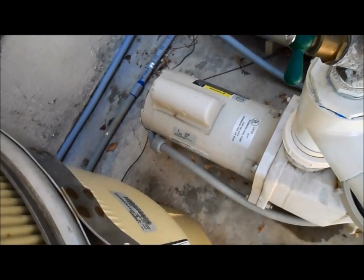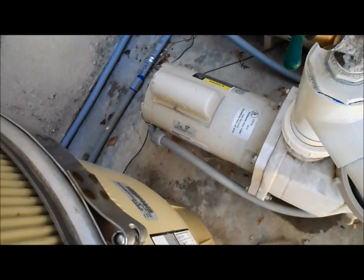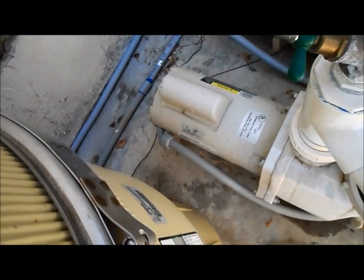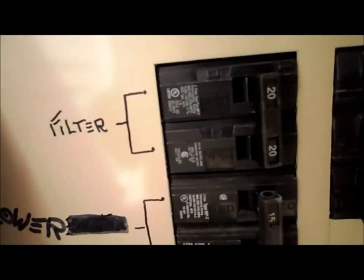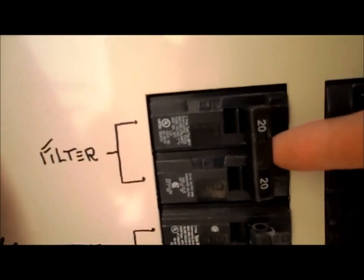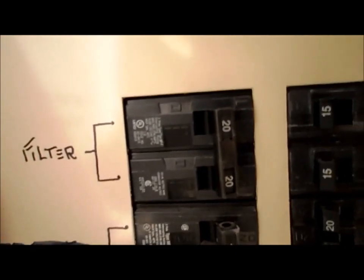You know if it's a 220 if it's got the double breaker tied together, versus the 110. That's a quick easy way to tell what kind of power source your motor has. Here's how to tell if it's 220 or 110: this is the pump hooked up to a 220 — you can see the breakers on a double thing. And this is a 110 breaker. So if your pump is hooked up to a 110, you'll know just by looking at the breaker panel where the pump is hooked up. Very easy way to know what voltage.